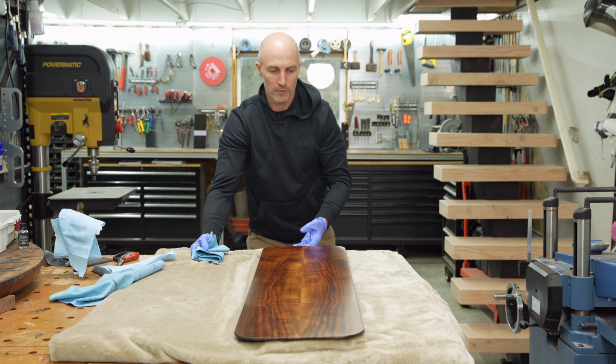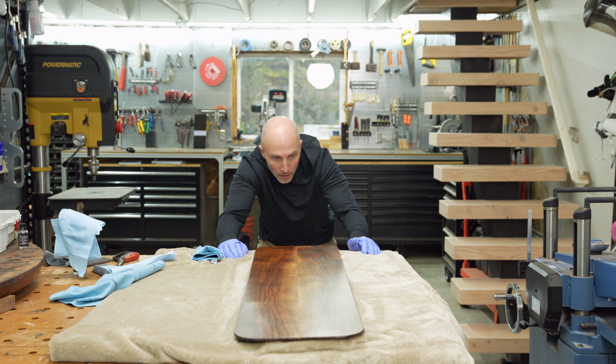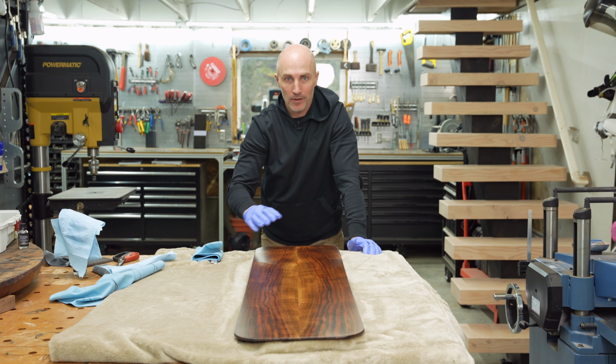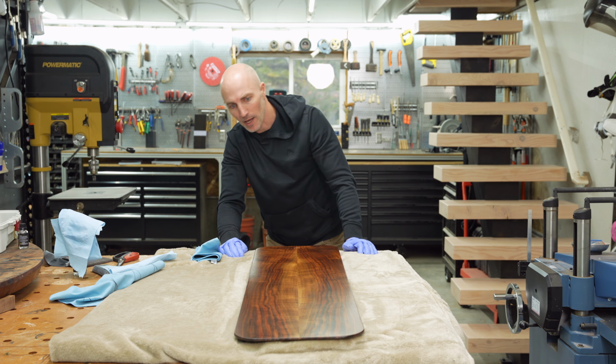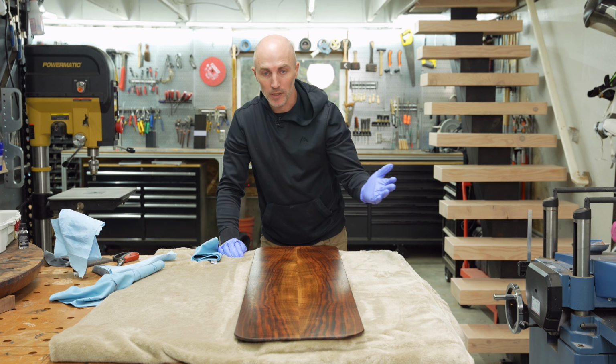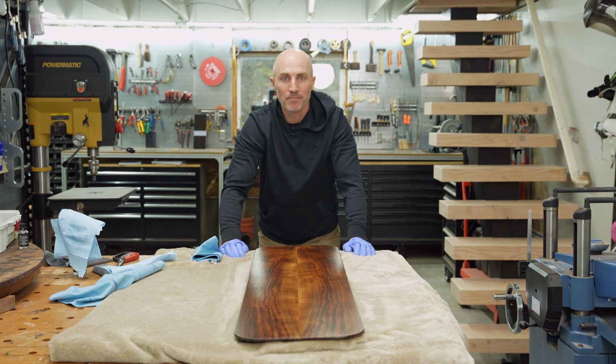That went about perfectly. Right now, I can't see any of the streaks that were there before. I still think it can look a little better as I bring up that sheen with another probably 1 coat of the hard coat, maybe 2 coats of the top coat, but the streak problem has completely gone away. So feel good about that, but let's make it look a little better.